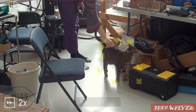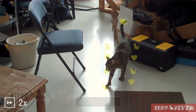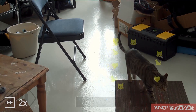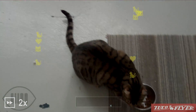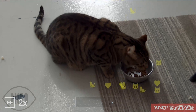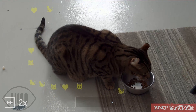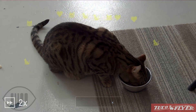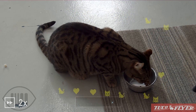So that orange rectangle there is my manual control, but when you just see those yellow sprites marching around Tuco, that's when the computer vision algorithm is trying to track him and might be doing so successfully. Seems like we're doing all right so far. You'll notice he's not quite in the middle of the frame, but when he moves toward the edge we kind of scroll over toward him. Now there's a bug I was having at the time where the gimbal couldn't aim very far downward or its axes would start vibrating. I can adjust the gains to try to fix the root cause, but when this video was recorded, the best I could do was to automatically aim the gimbal toward its home position to recover. But here you can see that behavior oscillating with the computer vision tracking. Now it's doing an okay job, but it's somewhat noisy — you can see the gimbal jerk around occasionally. This is a symptom of the tracking PID controllers becoming too sensitive to computer vision tracking noise when the region of interest is so large relative to the screen.